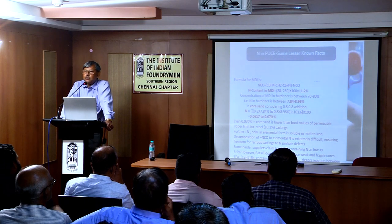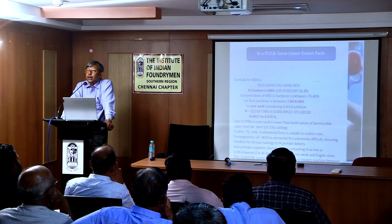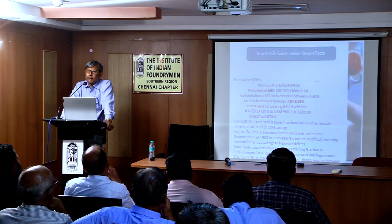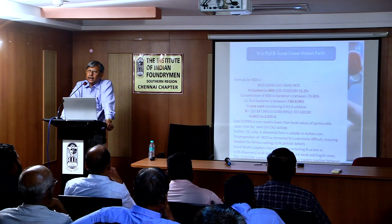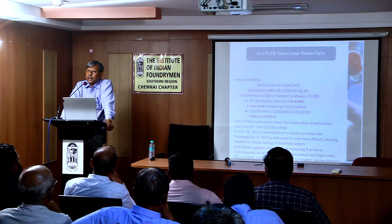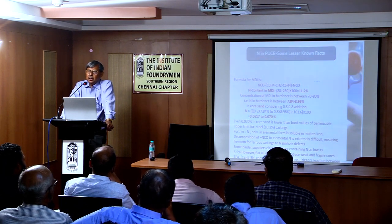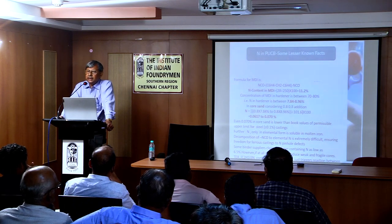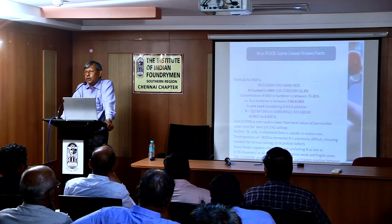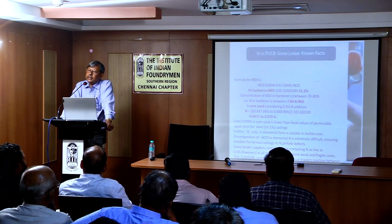Now comes one lesser known fact. I don't know about this region, I have not heard, but in the eastern and northern regions, many foundries talk about the nitrogen content in the hardener, and they ask, what is your nitrogen content? And as usual, suppliers keep on telling lies to the customers. Whenever there is some pinhole in the castings, they tell that it is because of more nitrogen content in your hardener. And they start checking nitrogen content.